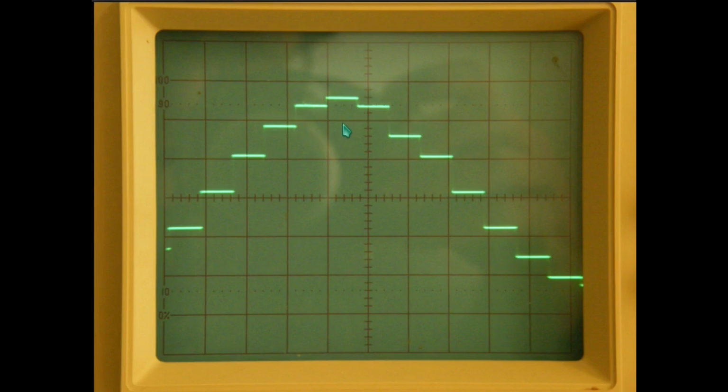My channel 2's synchronization has shifted from the negative going edge through to the positive going edge here. So therefore my timing calculations need to change accordingly. My time base is set to 0.2 milliseconds per division. So therefore you can see that phase 2's output with reference to phase 1 is 0.2, 0.4, 0.6, 0.8 or just under a millisecond.